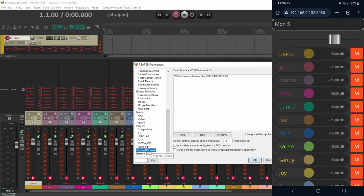We're done with the MR18, but let me show you very quickly how to do this on the M32, as it's slightly different. In the M32 routing menu on the alternate page, there's no USB or card out — you cannot send card channels from the alternate output, and the same applies to the out page. So go to the AES50 page and assign the AES50 output to card 1 to 16. Then on the alternate page, assign what you have on the out page — change the tap to post fader and assign mix buses 1 and 2, with 15 and 16 as the main left/right. When you plug the DN4816O box to the alternate of your DL32 stage box, you'll get the card outputs coming from Reaper.